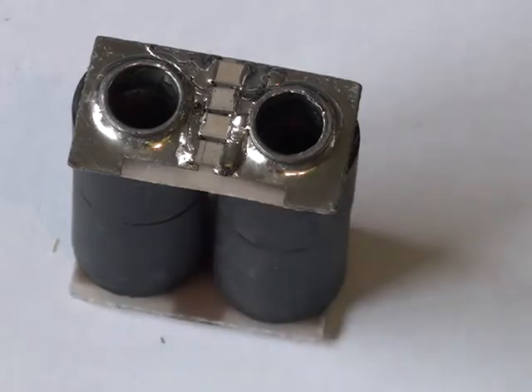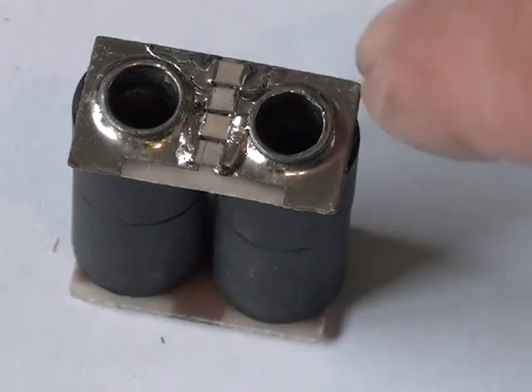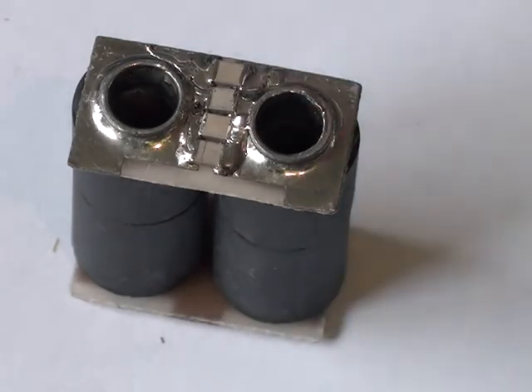Now, having done that, I'll wind the wire through the core. I will need more capacitance, but I'm going to add the capacitance across the top later on, because I may need to adjust the value to suit the particular load and transistors I'm using.